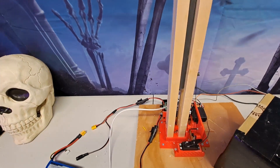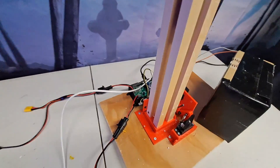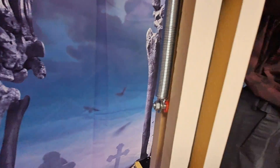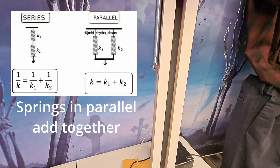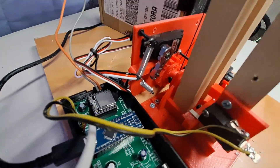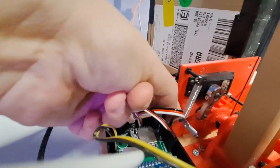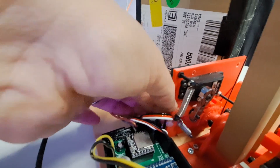On Scares and Sparks, I want to put some sparks in it, which means electronics will drive the thing. The two springs are connected through by a bolt with spacers, pulling on both at once — you can use one for reduced force depending on how heavy your load is. Down here there's a plastic plate with a servo motor, a metal gear servo with a metal servo arm, moving a plastic arm in and out. Two springs keep it in central position so it doesn't flop up or down.